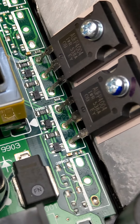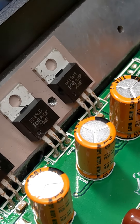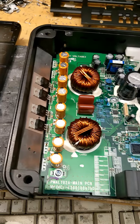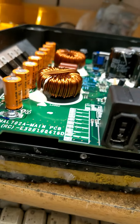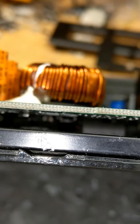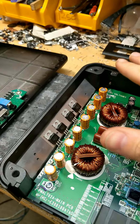Quickly looking over this: we've got AUFP4004 monstrously powerful power supply FETs, some drivers right by the FETs, and what looks like a TL494 - pretty standard in most car amplifiers - generating the PWM for the power supply section. There are some rail caps here, and the output MOSFETs are IRFB5615 - very fast MOSFETs good for high frequency switching. There's also a transformer over here probably generating auxiliary supply voltages like plus/minus 15 volts for the preamp op-amps. I suspect the drive circuit for the output section is on the back of this PCB.